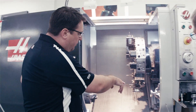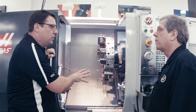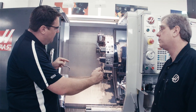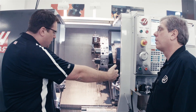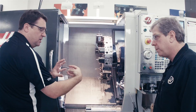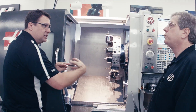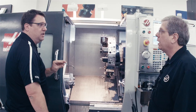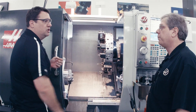So we finished the second operation on the second spindle. Let me make sure I understand this right. What's going to happen is we're going to have a G-code that gets the spindles synchronized. Then we're going to bring the B-axis — which is the second spindle — up to the main spindle. We're going to clamp with the main spindle, unclamp with the second spindle, get out of the way and go right back to machining. Exactly, and it's a single G-code that does that synchronization of the spindles.